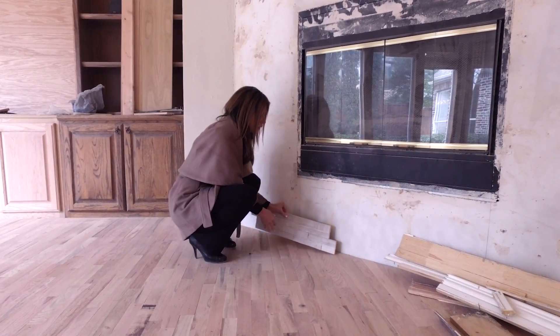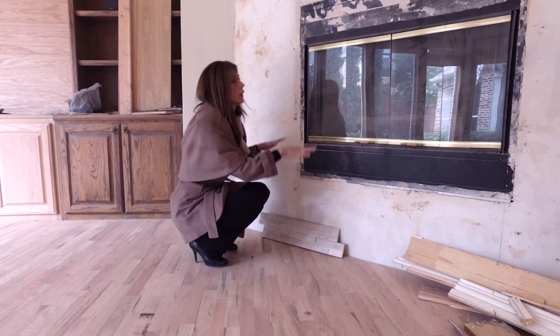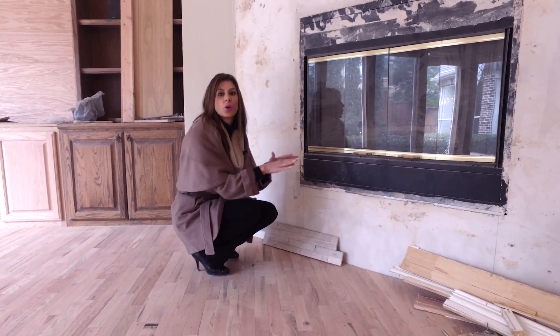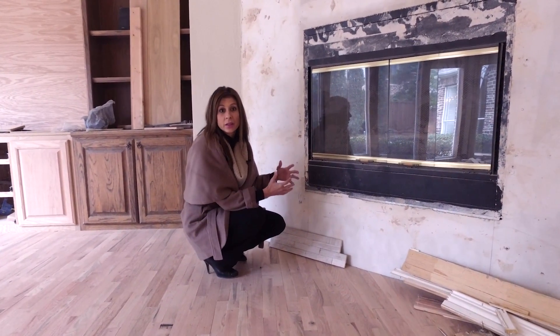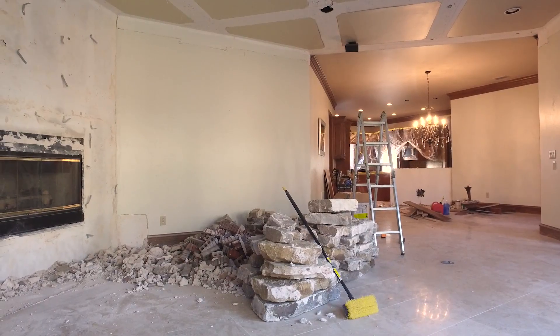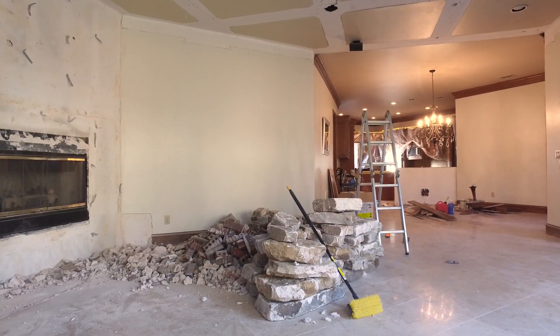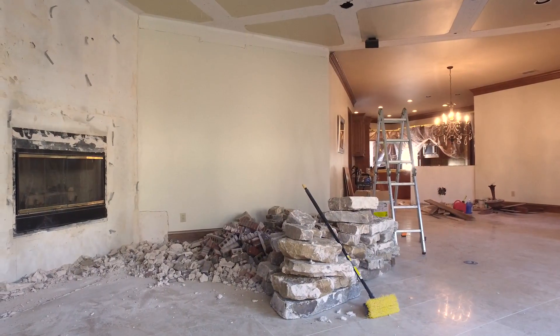They put quickset on the back and then install them, but the trick is you sometimes don't want to do all of this at once. You want to do a couple of layers because it's so heavy — let it dry and then start the next day so everything doesn't come sliding down the wall. This is going to be a really cool finished product whenever it gets completed.